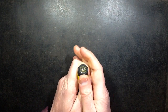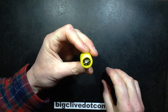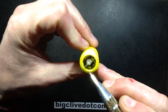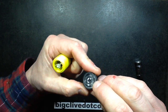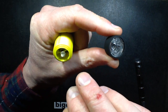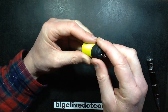The front comes off these — I've had similar ones before with various random levels of charging. That comes off quite neatly and these all contain quite a nice little arrangement. They've got a circuit board, and if you look in you can see the circuit board and the little lithium cell tucked at the back. There's a little slide on/off switch and a wide-angle LED, which is quite good. It's got little latches that snap into position, and guide rails that go over the switch — as you turn it, it physically clicks the switch, so it is actually quite a good electrical connection.